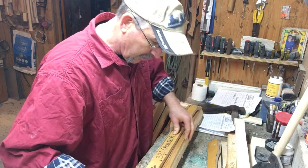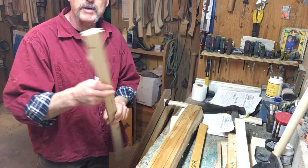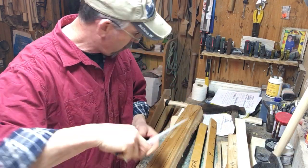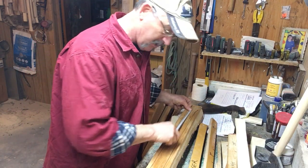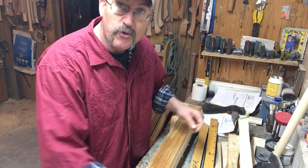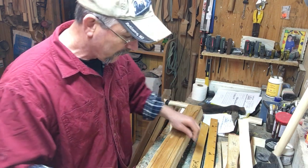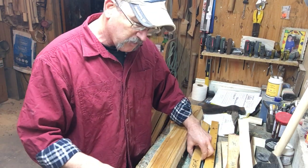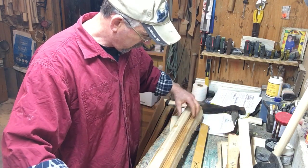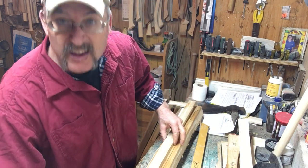Okay, and then because it's a hewing axe, I'm going to use my straight pattern, and I'm going to mark off the butt end where my 32 inches is. So that's going to come up, and 32 is right about here. So unfortunately, that little check down here has moved me up a couple inches that I didn't want to do. So now most of my bending is going to be up here towards the end. Okay, so what I'll do, 32 inch straight handle, so I'm going to run the bottom of this straight.